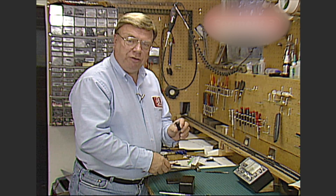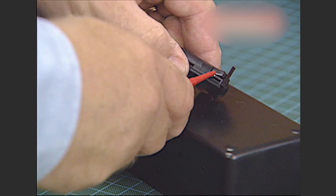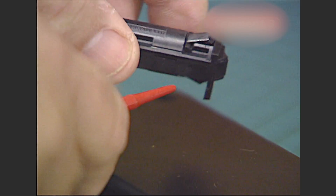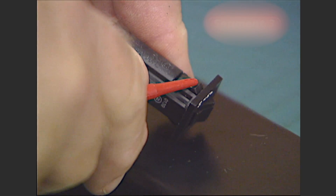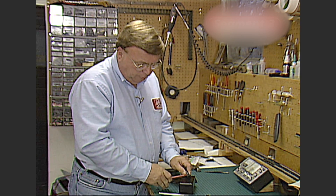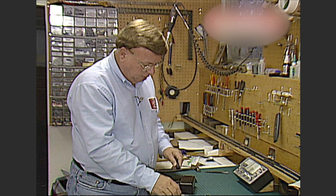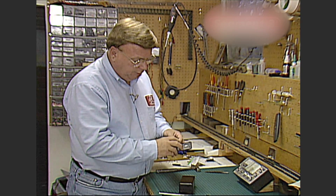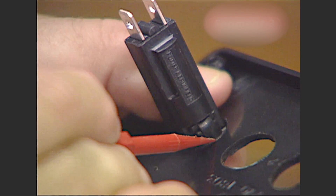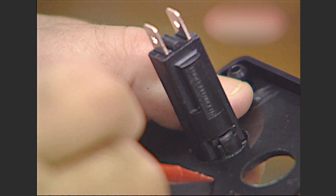The way the circuit breakers mount into a panel is that on the back side there are two locking tabs — they press in, spring loaded, one on each side. The only problem is that these tabs have very small clearance for a metal panel. Our plastic is just a little bit too thick, so when we push this through, the locking tab can't snap back over the plastic. This is an easy thing to fix.